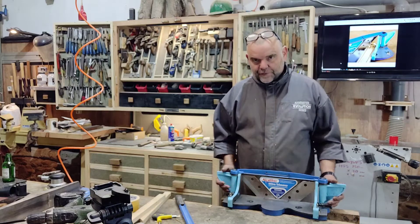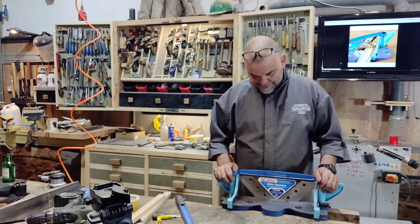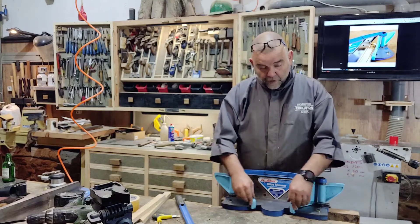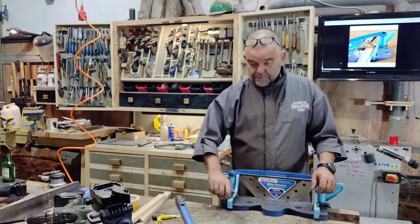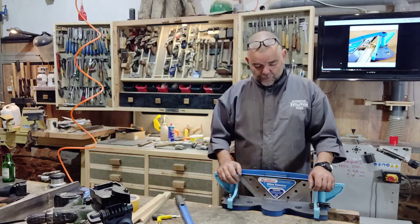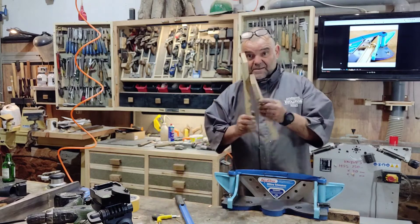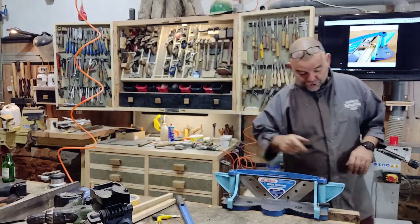Basically you have to make some fine adjustments. I'll bring you in a bit closer in a second, just so I can show you what I'm doing. Basically we need to adjust the stops for these fences for 45 and 90 to make it easy to set up. I do recommend that you pretty much have to set it up every time you want to use it, really, if you're going to do anything really fine. But once you've set it up once, you generally don't have to touch it again.